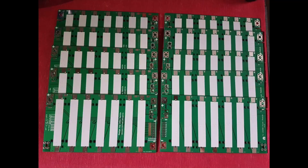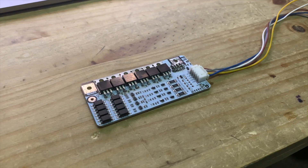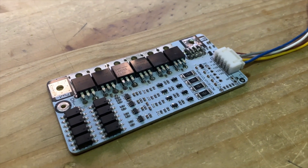This project is still in development, even though there's already about 10,000 out there. You guys are building a bunch of batteries, and so the question I keep getting is: what do we use as a BMS? For BMS, we have a couple of choices. We can use aftermarket BMSs like this — here's another version. This is a 4S, this is a 7S, so we're going to want the 7S because our system is for 24 volts.